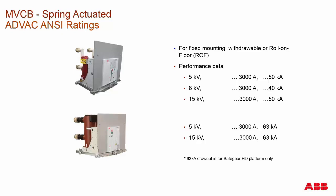What we do is take the 3,000 amp breaker and with forced air cooling we're able to get the 4,000 amp rating. Most manufacturers accomplish the same thing in the same manner. The current path can handle it — it's the heat dissipation that needs to meet the standard requirements.